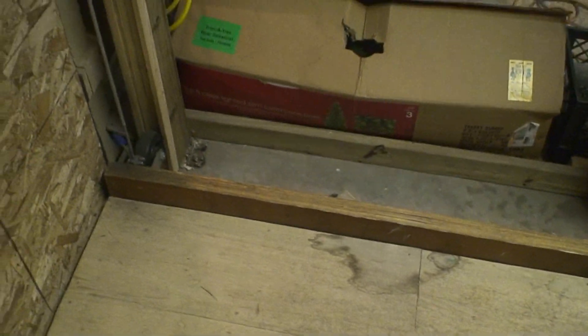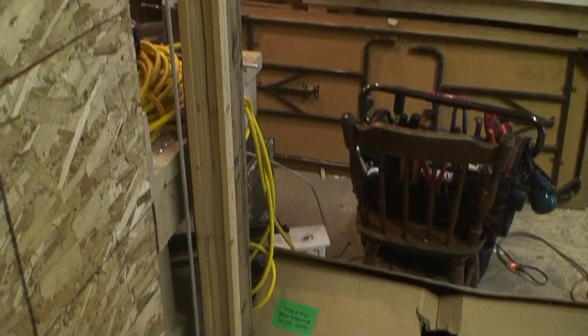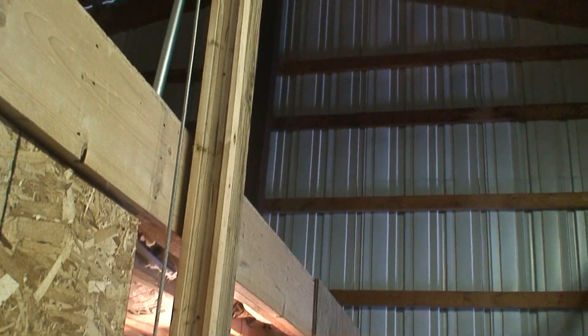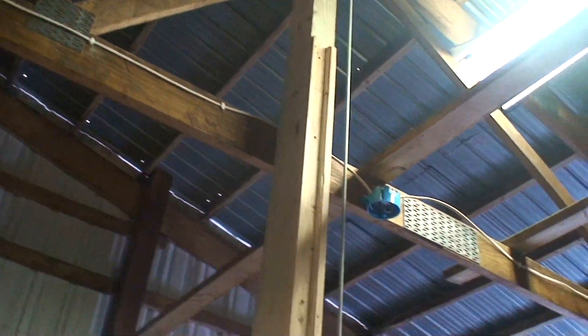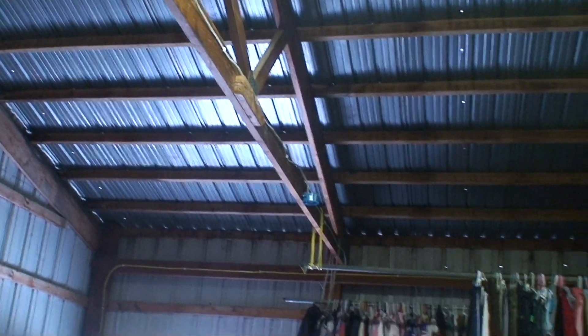Here's the little ramp for getting goods up on the platform. A five foot by five foot platform — I wouldn't go smaller than that. Four foot by four foot would be a little tight. This has given us a lot of room to put dressers and furniture up into the loft. It just seems to be a real nice size. You're going to be limited by your pole barn depending on how it's constructed — your distance between center lines on your trusses. In this older building, built in the 70s, our center lines on the trusses were eight feet.